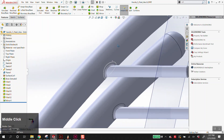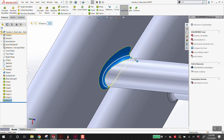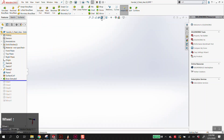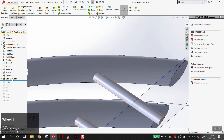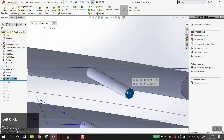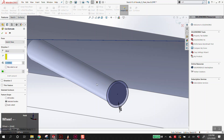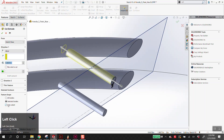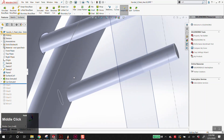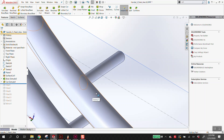This could be cast. One of the things Alex and I talked about was having exposed hardware. So for example, back here instead of having this blended, you could have this just be a cut. Here's a new tool — offset entities — it offsets the circle; if you offset it by 0.01, and then extrude cut this into this handle. Here's what's important: feature scope. I want to make sure I only cut this and don't cut the mounting point. I'll count that as a part line. There are ways around it depending on your construction method, and we can have those discussions on Monday during our review.